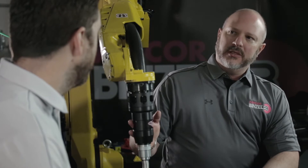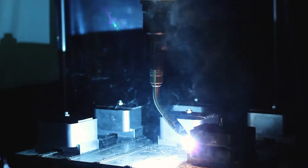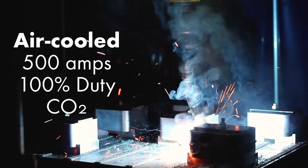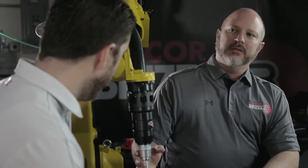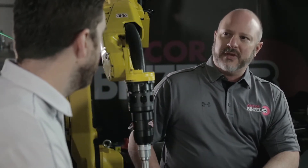Well Matt, the Cyclone gives you 360 degrees of continuous rotation around Axis 6. This is a 500 amp torch with 100% duty cycle with CO2. You can also put the 360 amp swan necks on the front side of this, but the module and the cable are all rated at 500 amp.